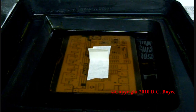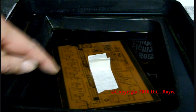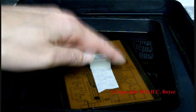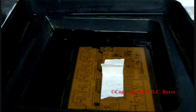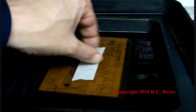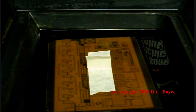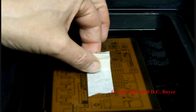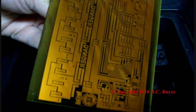A little bit of wiggles — I'll check in a few minutes. Usually from the top here you can look closely and see if all the holes are etched, which I can see most of them are. It gets pretty thick in there. We'll leave her sit for another minute or two — you do not want to over etch. She's looking pretty good there. Just wait for the solution to drip off a little bit and we can have a look and see how well the etchant made it through all the little holes and stuff. And that's the goal of that one.